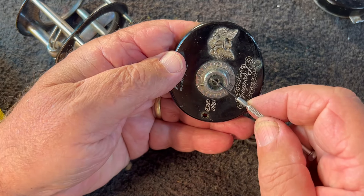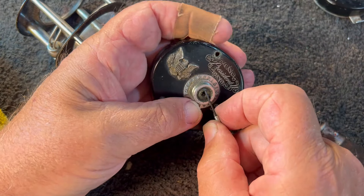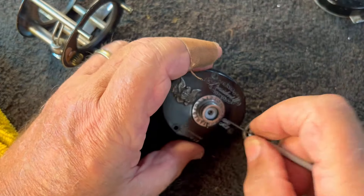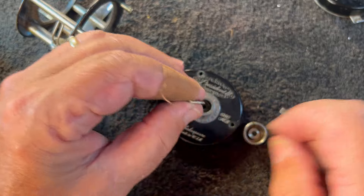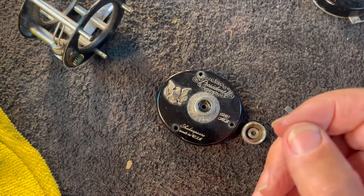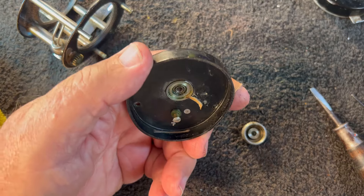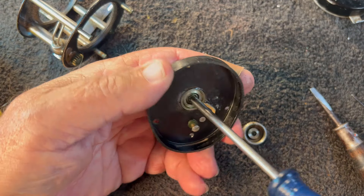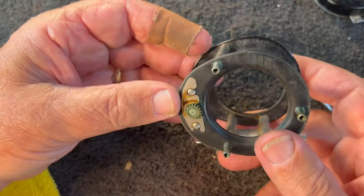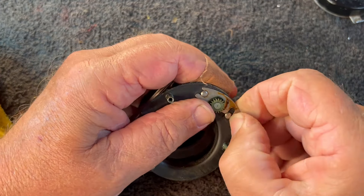Let's see what we've got here. There's a seal — it looks like a leather seal that goes in there. There is a stainless steel washer that's keyed on the bottom, and on top is a Teflon washer. Everything else that's in there is the bearing. Let's see if the bearing rotates okay — yes, the bearing is turning smoothly, so we're going to clean that in place and clean this up.